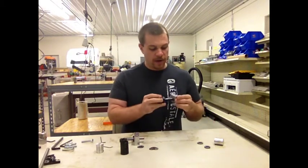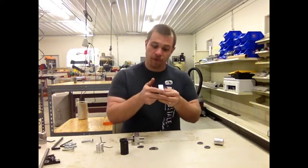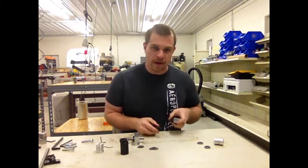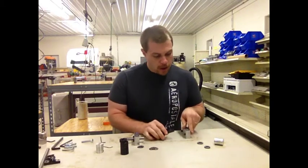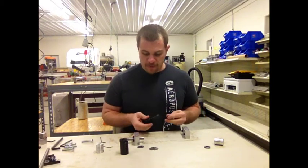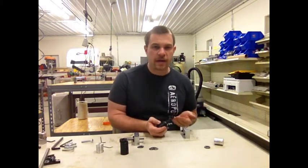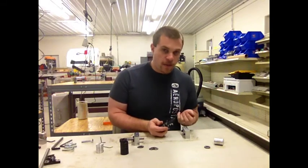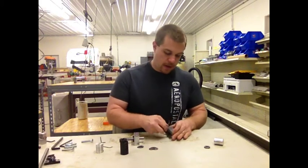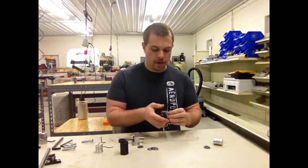It works out so much better because it slides in with a little press, and slides in and out easily. If you ever need to change them out, or change the bearings out, you can. It's much easier to assemble now. Instead of having to tighten down the shaft coupler, put the collar on, tighten the collar, and then tighten the motor coupler — the process is greatly simplified.